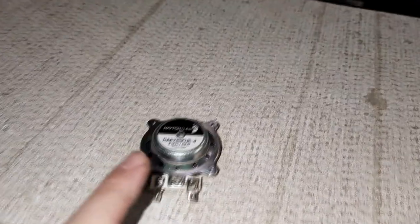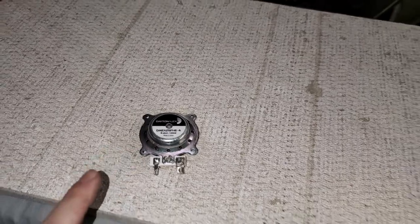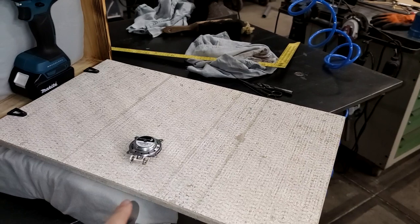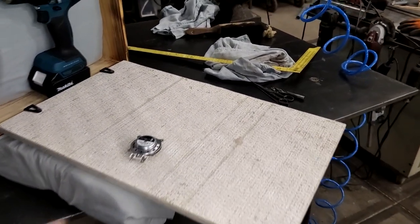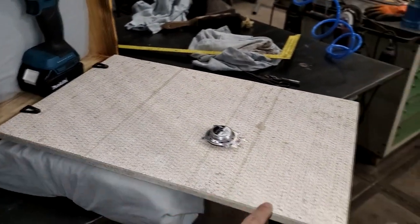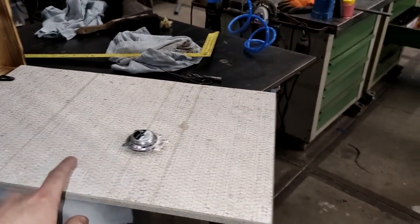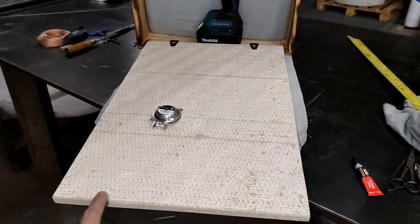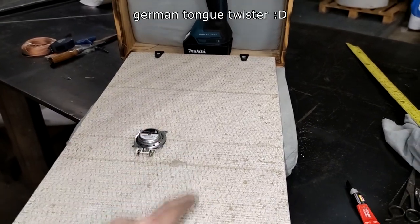This is a Dayton Audio, blah blah blah. You can find that in the description, I guess. So we're gonna place it on the backside of the panel, and what you have to do is, doesn't matter what the measurements actually are, you want to place the driver, divide that length by 5 and put that at the 2 mark in this direction, and also you do the same with the measurement on this side. So you want to place it to the 2/5, 3/5 rule.